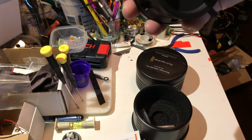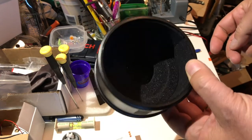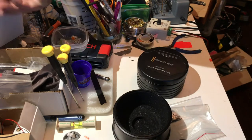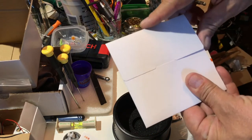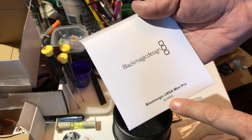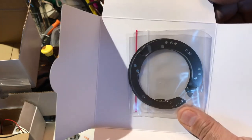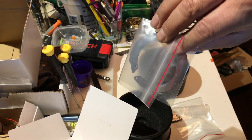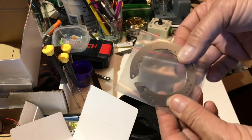It's got a little red dot so you know where to line it up — positive lock. Also in the box: eight screws, and there's something else — shims. If you're not familiar with shims, they go back to the film days where you would set the back focus for the depth of your lens mount, and then all the lenses would correspond as long as you kept your lens mount spec properly and your lenses spec properly.